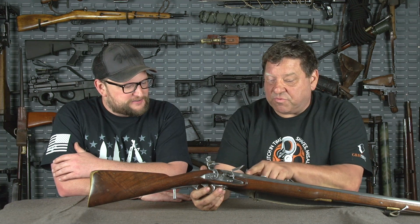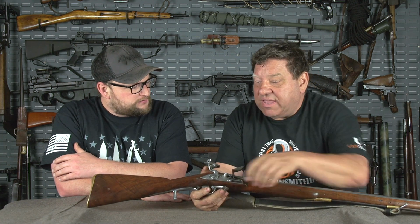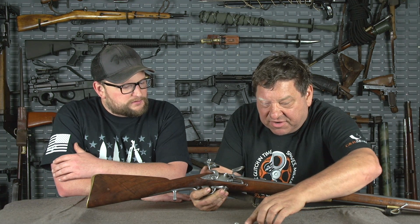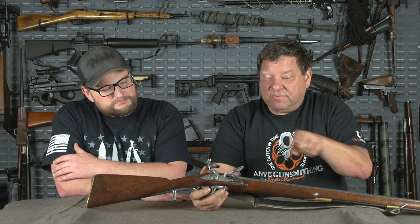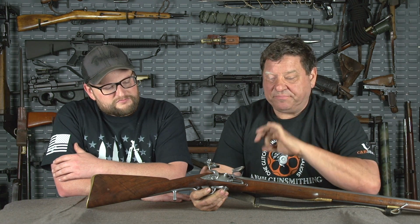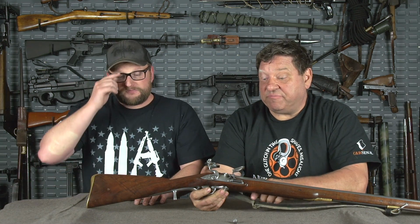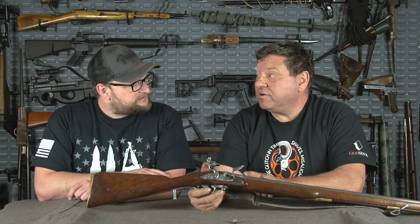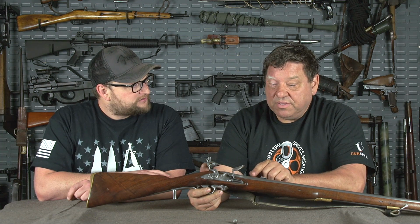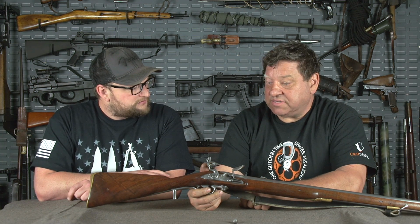Those 640 balls roll right in, and there's 40 thousandths of interference. Man, they engrave and rock, and I don't know how you're going to be able to show that, but there is a definite belt. That ball is no longer round. It's kind of round like that, and it ran. It's so cool, man. And it penetrated a lot of plywood. Yeah, there's about 100 grains of powder in this. This is not a sneezer gun. Yeah, this is a .62 caliber gun with 100 grains of powder behind it. This thing is really whipping up some hate and discontent.